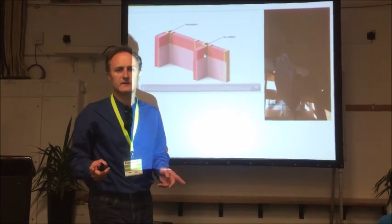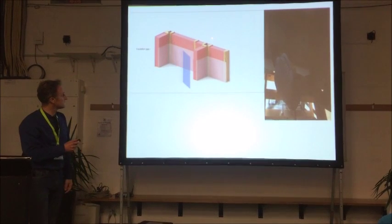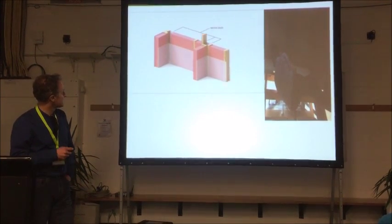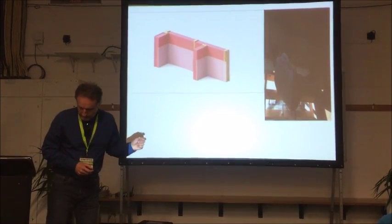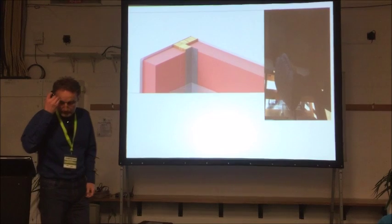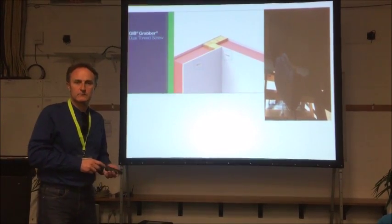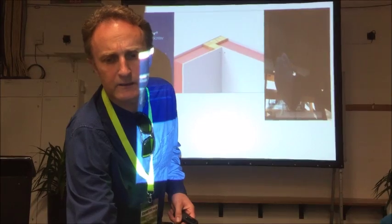This little animation describes that system. With the old framing, wind can whistle through the joints — there's no insulation, and you actually can't physically fit insulation in once the cladding goes on. Instead of having three bits of timber, we put more insulation in. The walls are screwed in, the gib is glued and screwed to a metal angle. That provides a better finish too — less likelihood of fixings popping and cracking. The dwangs come vertical, so you can run the insulation continuously.